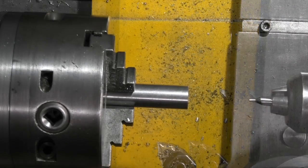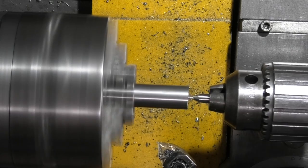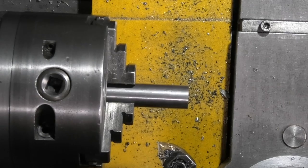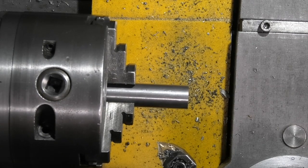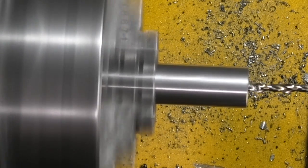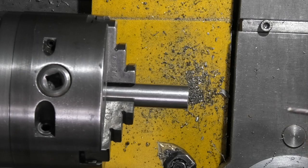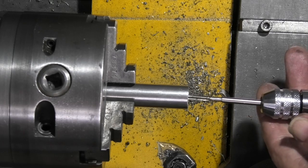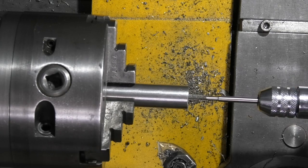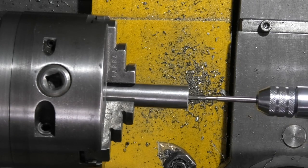Next, centre drill. The drawing just says drill a 3/16 hole and when you make the rod it just pushes into the hole, but I want to put a thread in there - I don't want the knob coming off - so I'll thread it 4mm and drill the hole. I'll put some oil on the tap; it should just fit in there. Bring the centre up at the back and now we should be able to tap this.